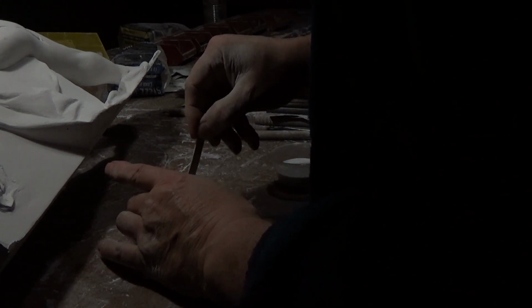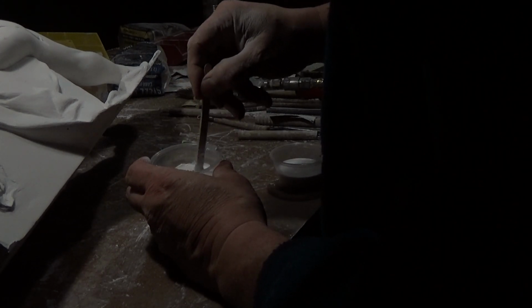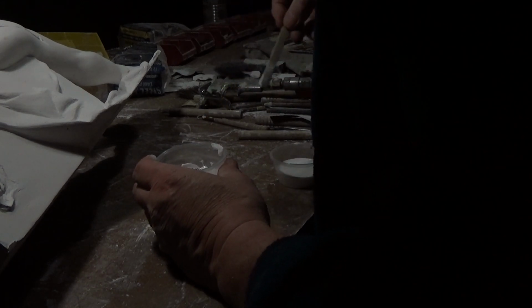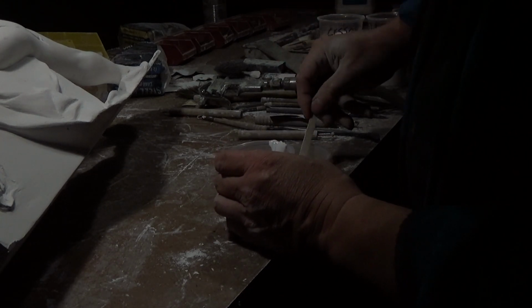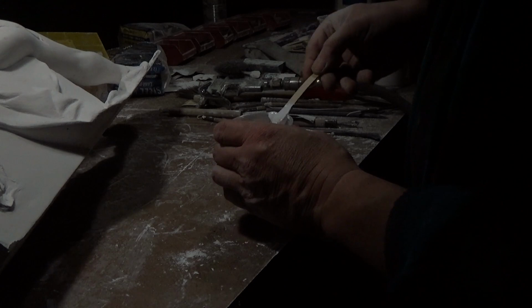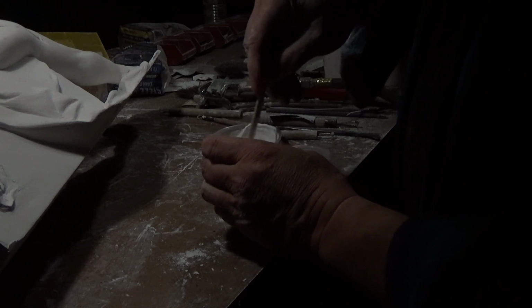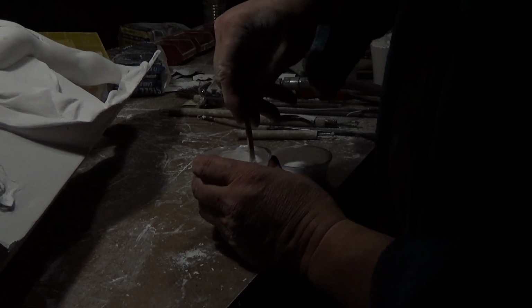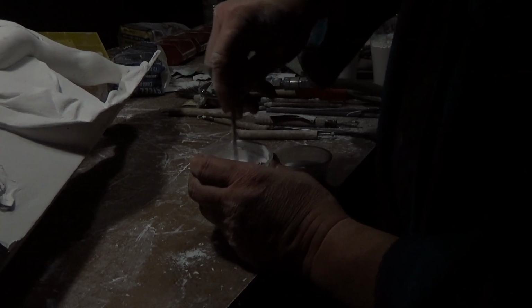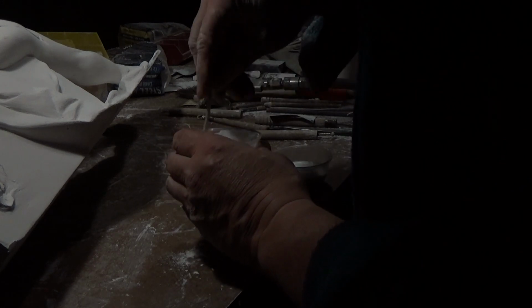After the gesso has been completely absorbed and is a paste-like consistency, then I add the white Elmer's glue. The white Elmer's glue is a hide glue, virtually the same properties as a rabbit skin glue. Rather than going through the whole process of making the rabbit skin glue, I find that Elmer's glue is a little easier to use. You want the white Elmer's glue. Another thing, the rabbit skin glue tends to have a hardness to it. So for purposes of gesso, I avoid using the original rabbit skin glue for the gesso.